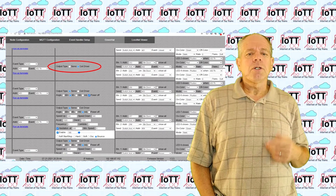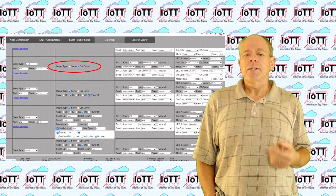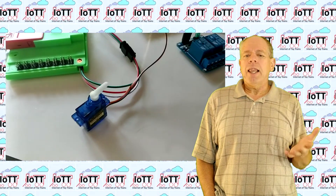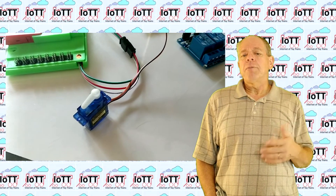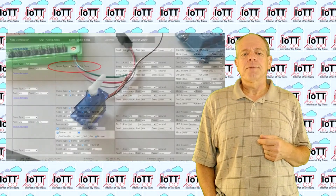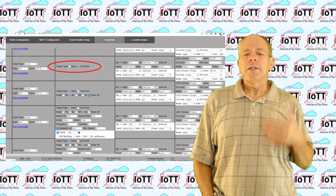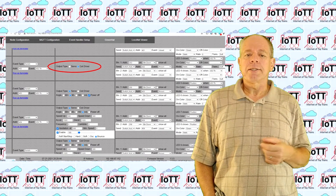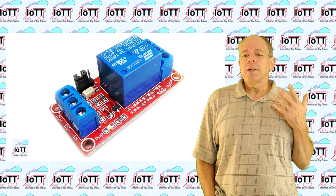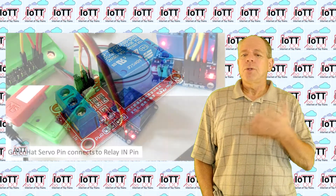Here is a screenshot of the changes to the green hat setup. In the first line of each channel there is now a set of radio buttons that let you change the output mode between servo and coil. In servo mode the channel outputs the normal servo PWM signal with a variable on-time proportional to the servo position and a repetition frequency of around 100 Hz. In coil mode the PWM output is either 100% or 0% and can be controlled by the usual sources like a switch address. The 3-pin connector can then be connected to a typical Arduino-compatible relay controlled by a 5-volt signal, turned on and off using a switch address or a block detector input.